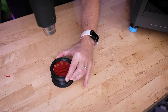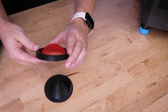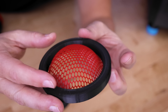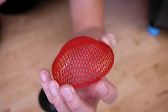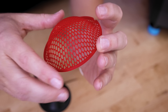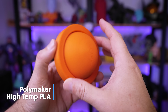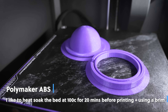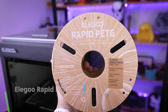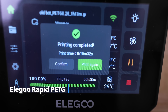Let's try it with the ABS — I feel like I've got a better handle on how to do this now. Going low with the heat and pressing down, moving it around. That turned out perfectly — just perfect. It's a very fine dance of applying a little bit of heat and force to get these pressed into place. If you can get Polymaker high temp PLA, this material works great. ABS and PETG work just as well for the mold boxes. You could probably get away with basic PLA using higher infill percentage and about five walls to give it a more durable finish.